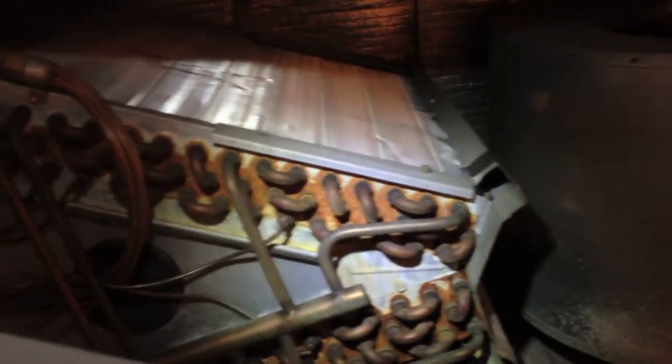I got into this indoor air handler here. We got our evaporator here, which looks like it's in pretty good shape — it's not really all that dirty. There's our blower motor. The first thing I checked when I got up here was this PC board, which has our fan relay on it.